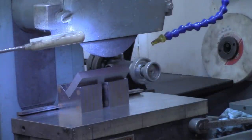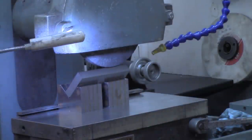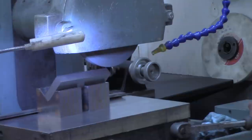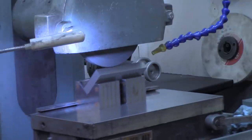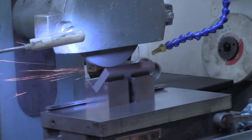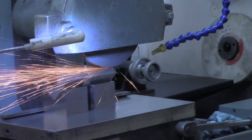So let me get it close now. All right, that appears to be very close. All right, I'm gonna go down, just touching at that end. All right. Now I'm gonna set the zero. You can't see it on the video, but I'm gonna set my zero. And I'm coming down a thousandth at a time.